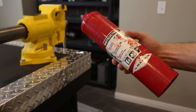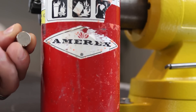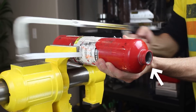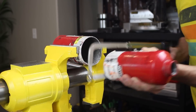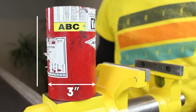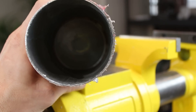While we're waiting, let's turn this old steel fire extinguisher into a custom crucible. You can tell it's made from steel because when we hold a magnet to it, it sticks — and magnets won't do that with aluminium. I depressurized the tank and unscrewed the valve from the top to make it safe and easy to cut in half with a hacksaw, which happened in less than a minute. The bottom part of the extinguisher is what we want for the crucible — it's basically a steel cup, 3 inches in diameter and 5 inches tall, the perfect size for our custom backyard foundry.